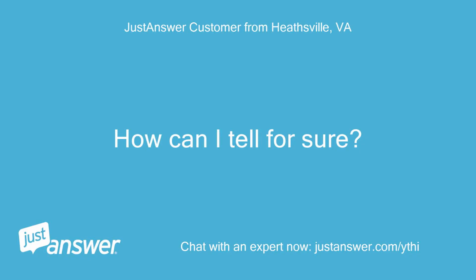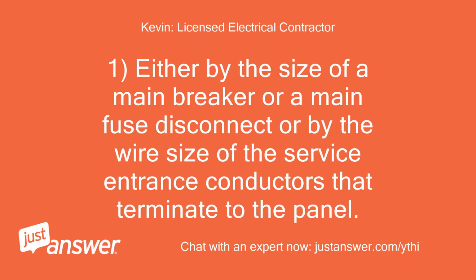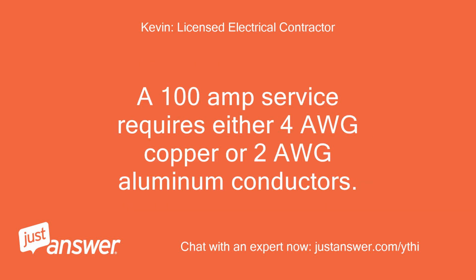How can I tell for sure? 1. Either by the size of a main breaker or a main fuse disconnect or by the wire size of the service entrance conductors that terminate to the panel. A 100 amp service requires either 4 AWG copper or 2 AWG aluminum conductors.